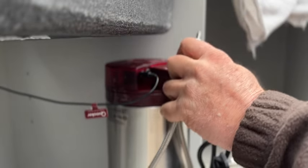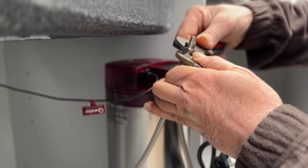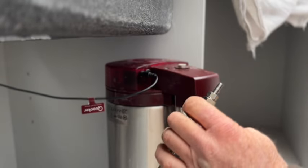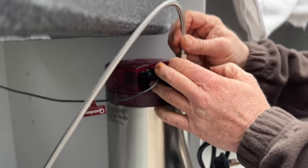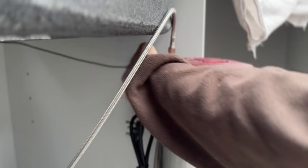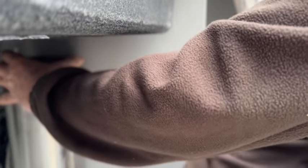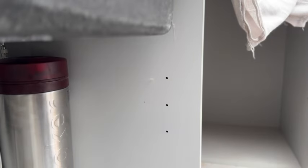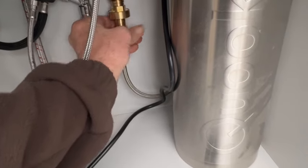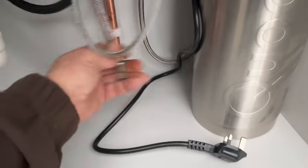Now let me be clear: this is not a cheap system. This is expensive, but you're paying for quality. Just make sure whoever's supplying your kitchen knows exactly what you need and what you've got in your house. If you don't have a hot water supply to the kitchen, make sure they choose the right model for you. And if you've only got a 500 or 600 base unit, don't expect much space inside it — once you install this system it's quite tight. This is a big tank that goes underneath, and there's a lot of pipework to go in as well. So that expectation of having a shelf and loads of storage space underneath — it's not going to happen. It took quite a bit of arguing to convince the kitchen supplier that they actually chose the wrong one, and I wasn't prepared to blank this hot water pipe off and rely just on scalding boiling water coming out of this tap. So we're waiting for the new year for it to be resolved.